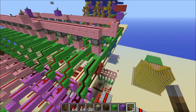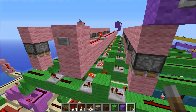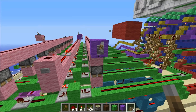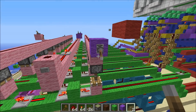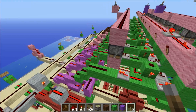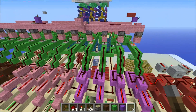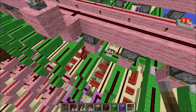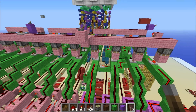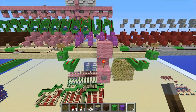When you've got five or more, you have to add three to it. I'll come down here and add three — just reset the memory here — and I've added three. I'm going to load the answer into this memory, stop that, then come over here and reset these registers. I want that answer in the registers, so I'll load the answer back into them. It was six plus three, which is nine.